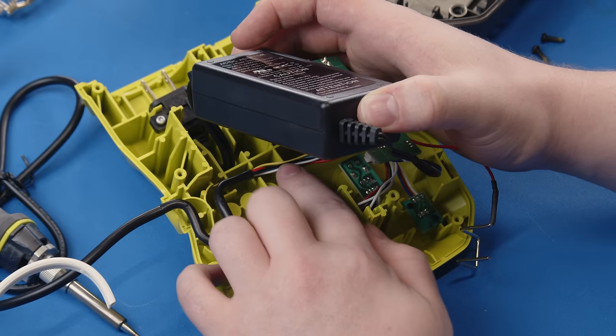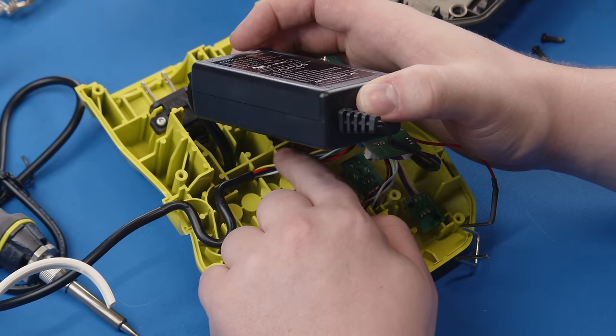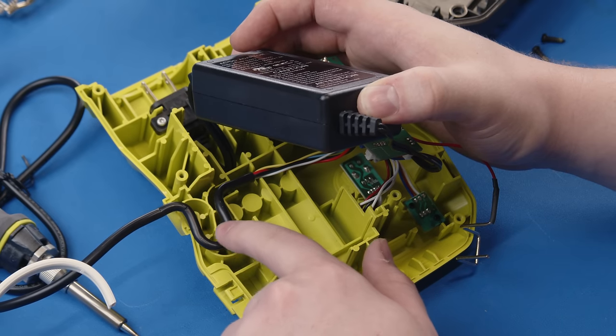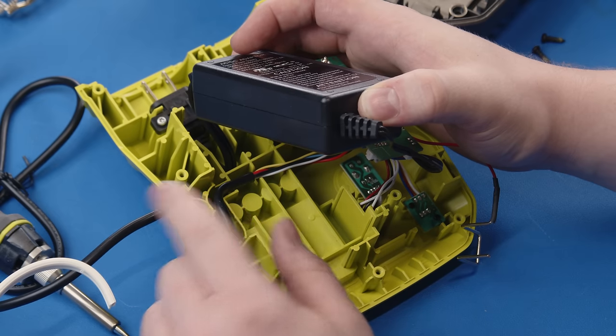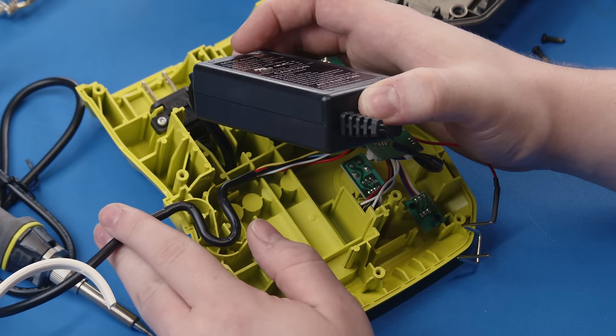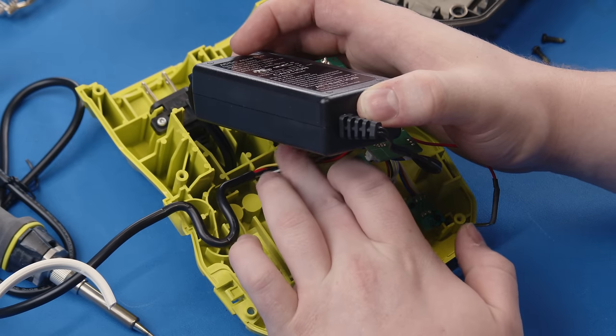But while we're in here, I'll point out that this stuff is also insulated with PVC, and it shouldn't be. This really wants to be Teflon, especially if it's going through a PVC outer jacket, because that's also resistant to heat, and it would make up some for the PVC outer jacket, but it's also just a better insulation for wire that's doing what it's doing.